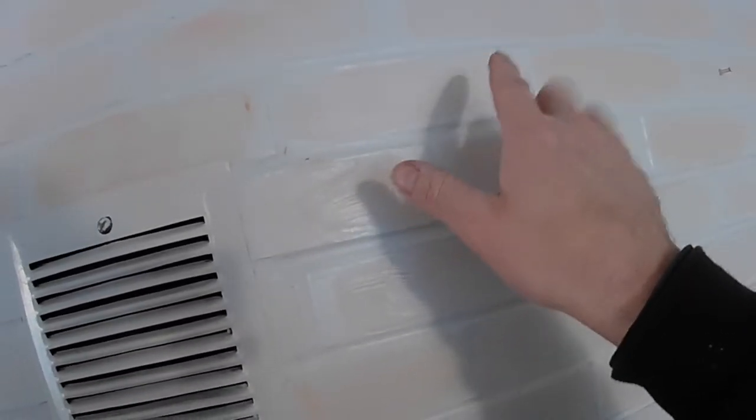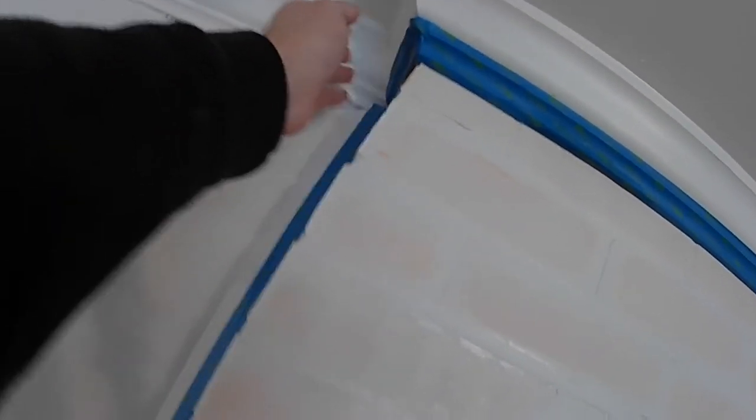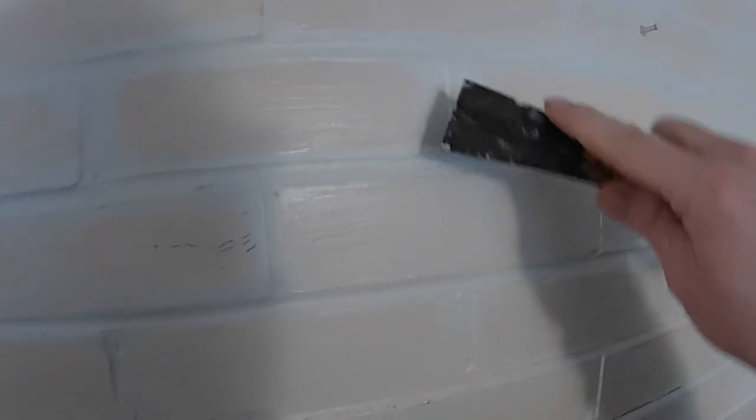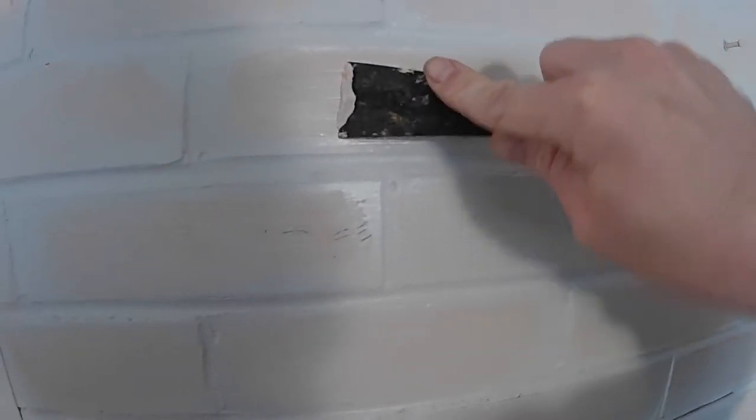It's been about 45 minutes and we just painted the face of the brick. There's less cleanup because we don't want it completely clean — we want to just distress it. The tape is coming off and it's a pretty light film, so we're just going to take any type of paint scraper or blade and scrape the face of the brick just to expose what's underneath — just a little bit of distress.